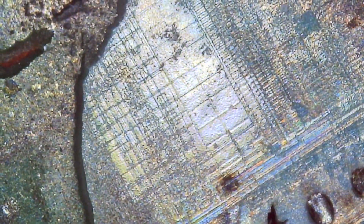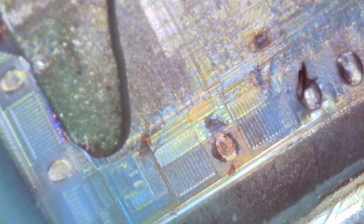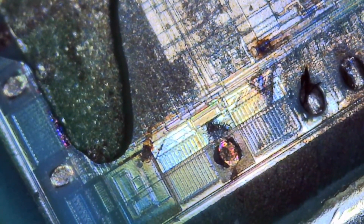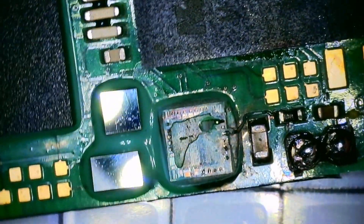You can actually see all of the little individual transistors or gates and all the connection points where it meets the rest of the PCB, and it just looks unreal. Obviously I can't even do research on this device anymore because I don't have that chip — I can't replace it. I reasonably assume that controls the controller charger for the defibrillator's capacitor, which draws it to like 700 volts. So those two wires touched — and I'll show you in a minute where they are — but have a look at the definition of those individual transistors. Those two blobs on the far right are the two leads, and you can see how close they are together.